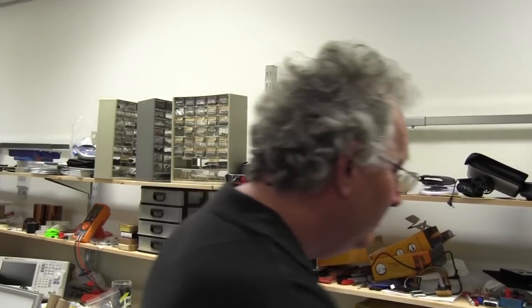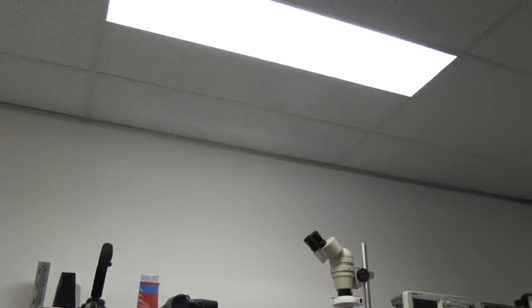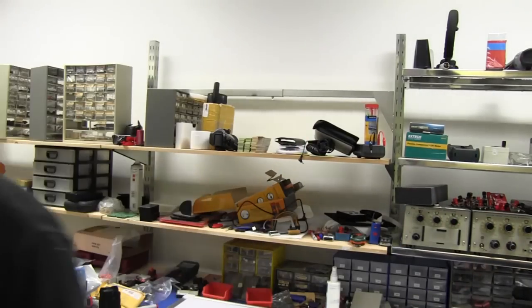Let's do it. So we've got two fluoro replacement tubes. We'll just replace this trough up here, both tubes in there. I think we'll try that one because you seem to spend more time at this end of the bench. And we'll probably position the LED tubes, which are three metres long, roughly evenly - maybe pushed up towards this end because this is the dark end. And they're monsters.